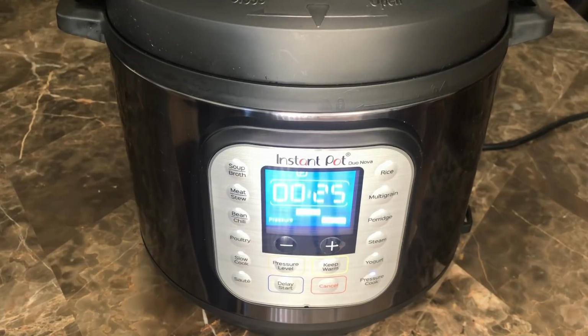We're going to sand it down anyway to give it a brushed aluminum look, so you don't even need to do this. I just chose to do this because it's less sanding, less work for me down the road. But what you're going to want to do is put your pressure cooker on high steam. I use just 2 cups of water, put it on high pressure and put it on for 30 minutes. Then 30 minutes later, you just bring it out, let it cool for a few minutes, and then you can start rubbing the acetone on it.